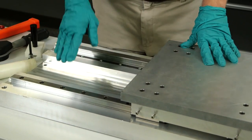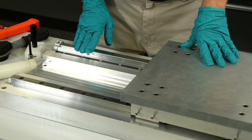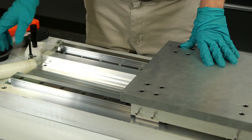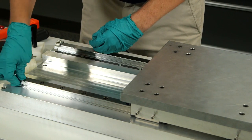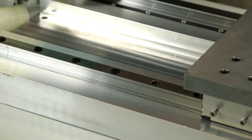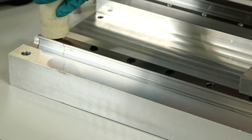As you'll notice, the bolt holes for our float rail are not protected. Our master rail or reference rail — those holes are protected with cover strip. Usually I would put cover strip on both sides, but for demonstration purposes, I'm going to install the plastic caps. Now that I've got a few in there, I can just use my mallet to finish off putting the cap flush with the top of the rail.